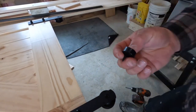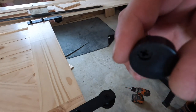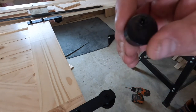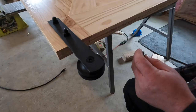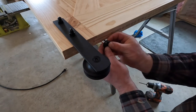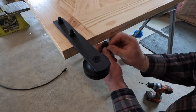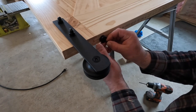We're going to install the anti-jump blocks. They're offset — off-center — see the screw hole there, it's offset. You don't put it in the center of the door. This is so your door doesn't jump off the wheels and end up on the ground. Put them just on the edge and then rotate it so it doesn't jump off.